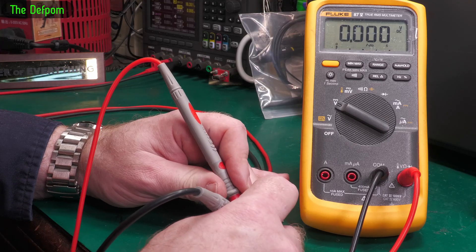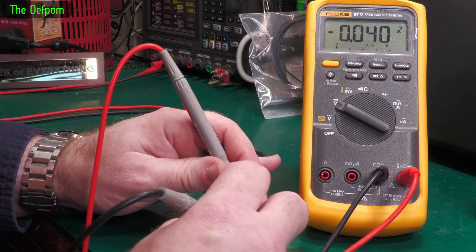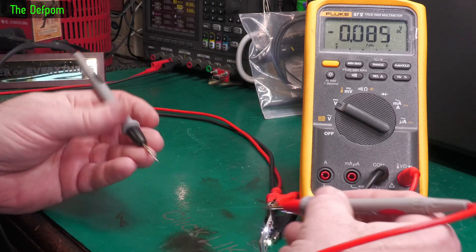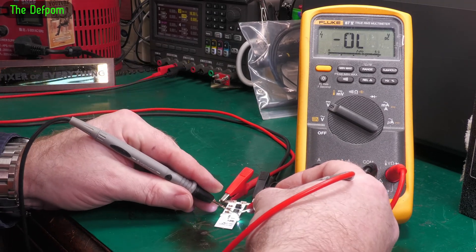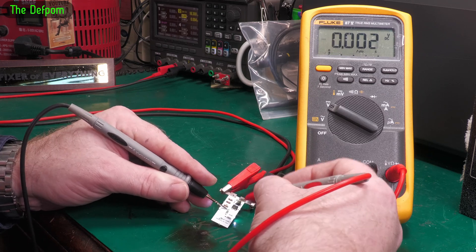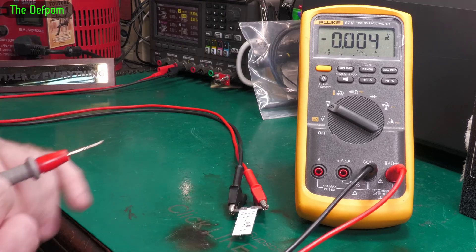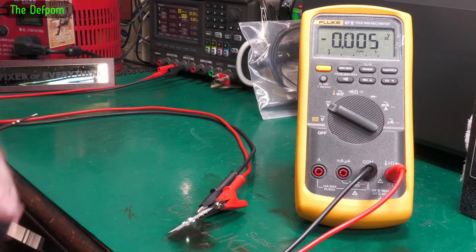Across the MELF resistors - 230 millivolts, same across all of them. This little surface mount one - same. The one on the back - same. So the voltage drop across all the resistors is exactly the same; no single resistor is standing out. Then checking the bridge - putting probes across the bridge: 14 volts, while I'm injecting 16.3 volts, so a bit of loss through there. It flickered a little. Going up more to 17 volts and it's now dropping out - it's breaking down. This is supposed to run at 24 volts.